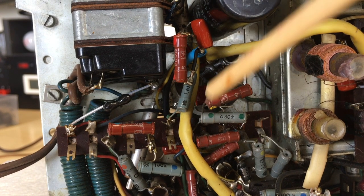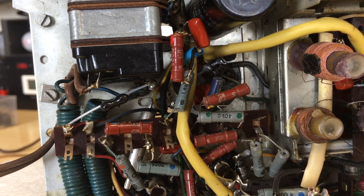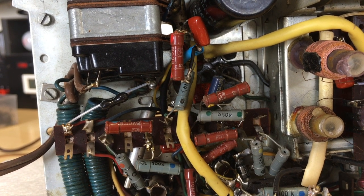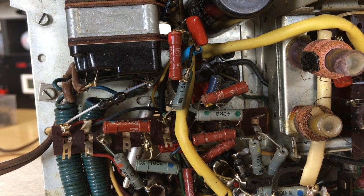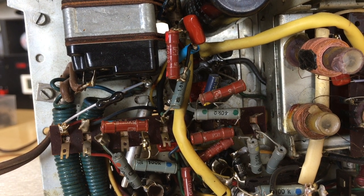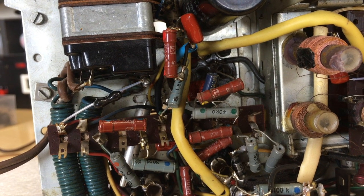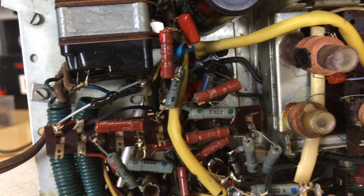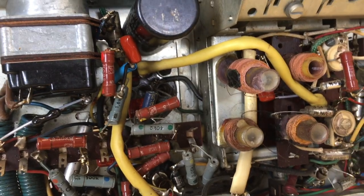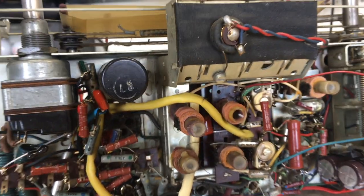The wire underneath goes past all sorts of places where it could pick up hum or other noise, and the result is in part due to that shielding. There was absolutely no shielding originally. I'm surprised — in some cases you actually have a shielded capacitor, as I've done in restorations before. I've even done a video on how to make one — a shielded cap with three pins: the two normal capacitor wires, and one connected to a shield around the capacitor connected to ground. I'll link that if you're interested. Other than that, that's the underside.